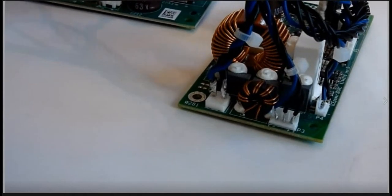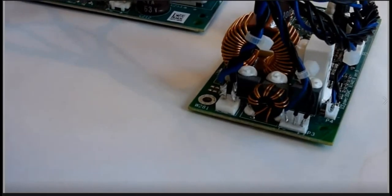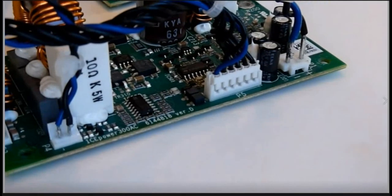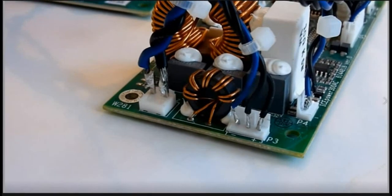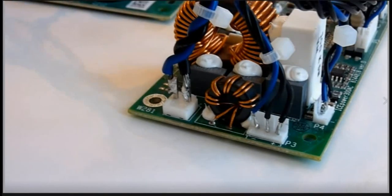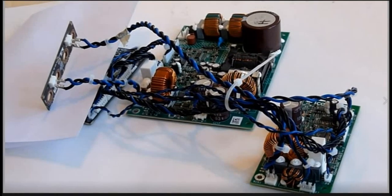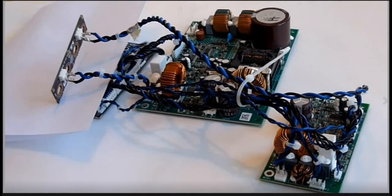I have removed parts of the plastic walls surrounding the terminals on the boards, and cut the wires from the female part of the terminals so that I can solder the wires directly to the terminals. It's possible to continue removing the mechanical terminals where you have more than three wires, but for me it was a bit difficult to perform the soldering so I let them be as is. After soldering the wires to the terminals I cleaned the solderings with a bit of methylated spirit before applying liquid rubber to the solderings for insulating purposes. What it takes is skill regarding soldering, time and patience.